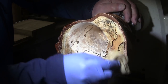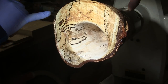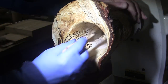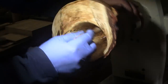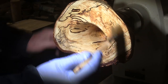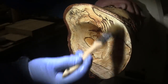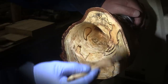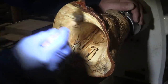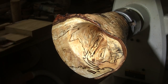I like this piece quite a little bit. I think I made the right choice trimming off those corners early on — it gives it more of a natural shape than if we had two corners sticking out up here. Sure is some beautiful spalting. I can't get my hand all the way in there so I'm going to use a brush. Well, that's about what it's going to look like. It's like it's punky but it just isn't — I don't know how to explain it. So I'll get a couple of coats of sanding sealer on, a couple of coats of shellac like I did on the outside, then we'll take that tenon off.